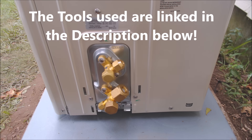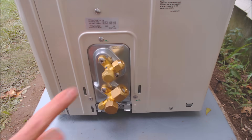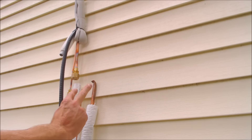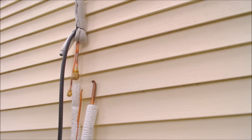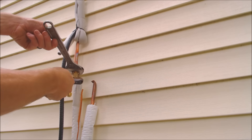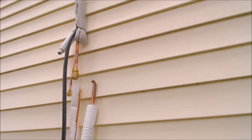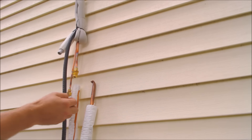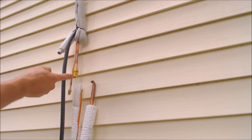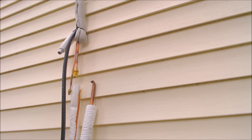I'm going to take you step by step through the process. We're going to start up on the outside wall where our copper tubing is extended out from the indoor head unit. We're going to need these two nuts in order to flare these two tubes right here, so we're going to go ahead and take those off. I'm going to put a little tape over these two — not the adhesive part on the ends — just to cover them up so I don't get humid air inside.